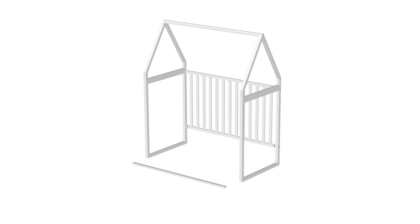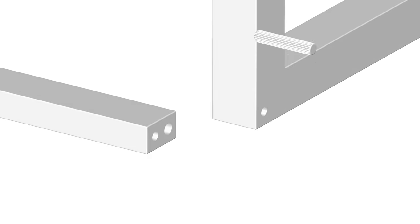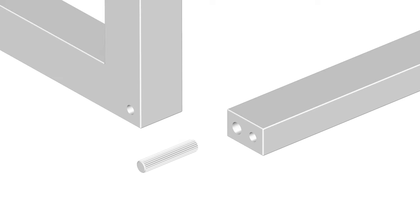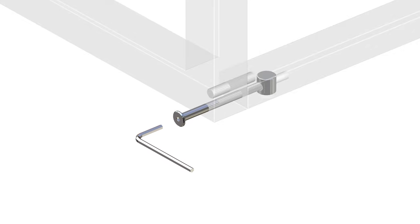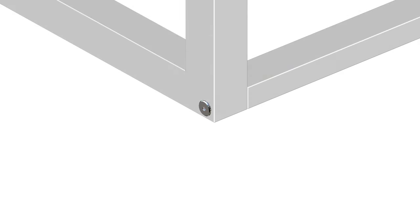Finally, add the conversion rail, part number 16, at the bottom of the assembly with the long face of the rail parallel to the ground. Insert one wooden dowel on the end of each interior hole of the rail. Slide the rail with wooden dowel into the corner holes. Grab a barrel nut and insert it into a hole located on the bottom of the conversion rail. Add a part C bolt into the barrel nut from the outside and secure the bolt using an Allen key.